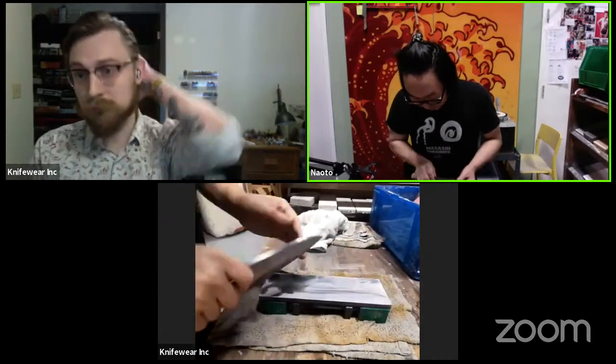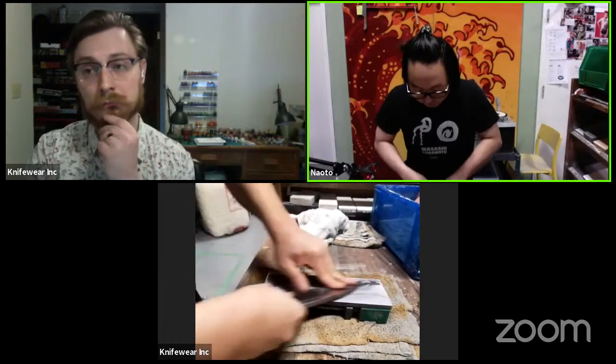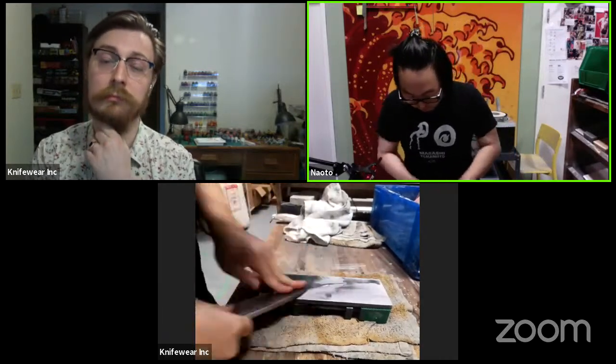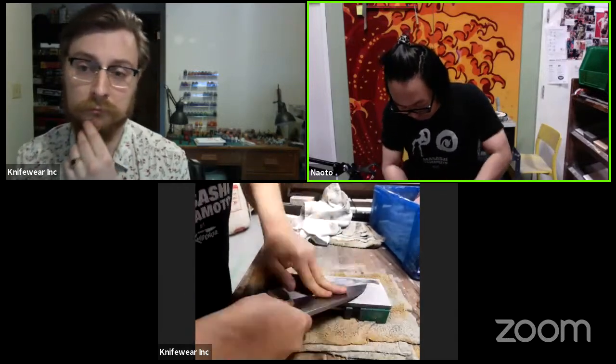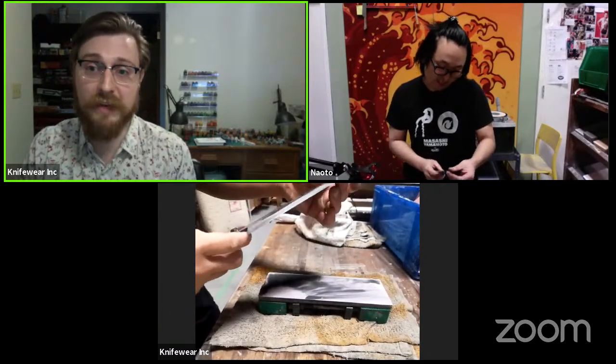I'm not sure when or if I'm going to, but I just took a whole video of me using the wheel and this sharpening the other day. Maybe I'll do a really fast-forward video and upload it somewhere. What I do, and I didn't realize, is I do 5-6 strokes and check, 5-6 strokes and check, pretty frequently. That's really another key to success, because you don't want to sharpen one part too much, right? That was something that made me a lot better at sharpening that I picked up from you: you seem to spend almost as much time looking at the knife as you do sharpening it, and I found that's really improved my skill, just adapting that technique.